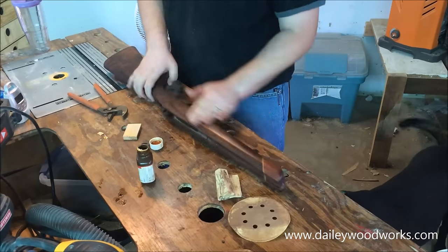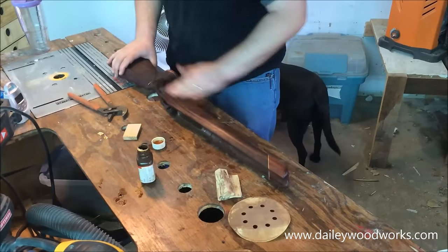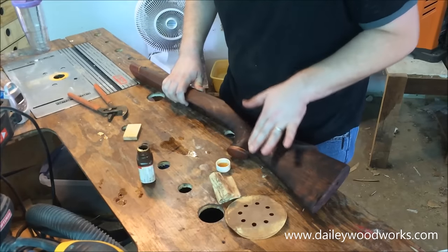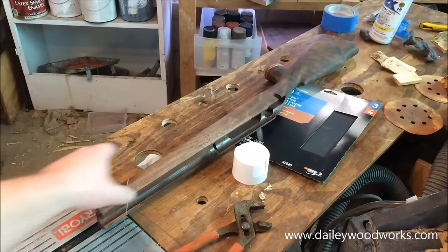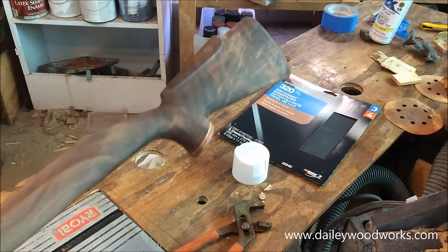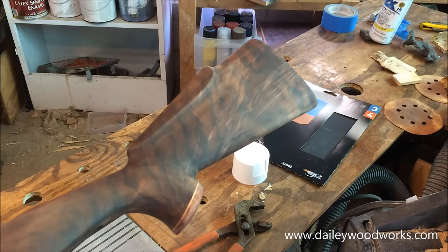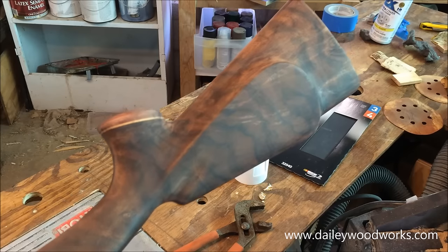You want to wait about two hours between coats. After that time, come back and put another coat of the diluted True Oil over the top and let that dry an additional two hours — I'm in West Texas heat, so two hours might not be long enough for you. Here we are today: we've got our stock sanded to 220 with a coat of oil that's soaked in really good.